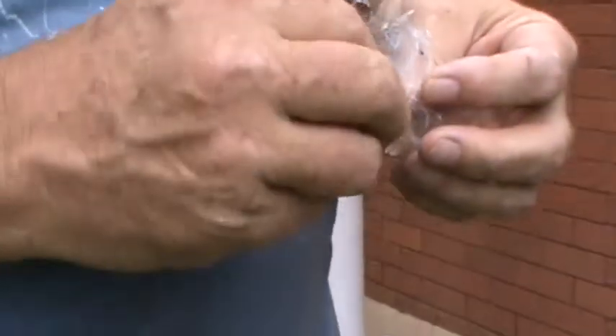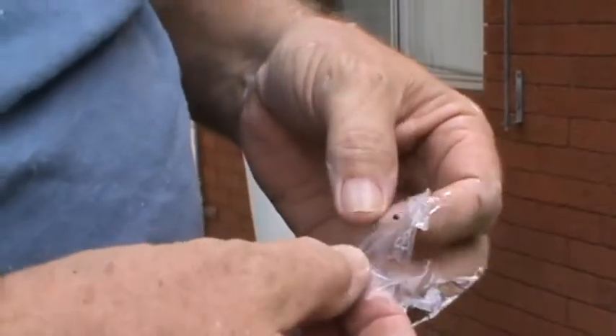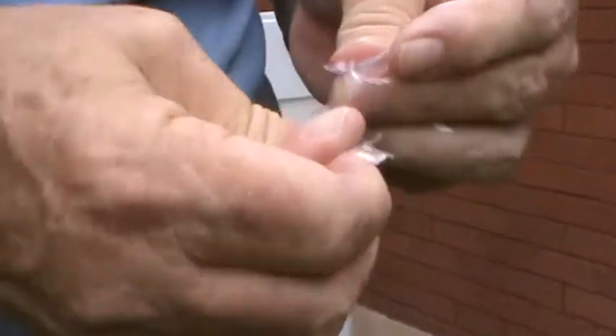After 24 hours this becomes very soft as a film — the waterproofing. But as you can see, we've left it 7 days now so it can cure before we put any paint on it, let alone any soil in there. It becomes a little bit more brittle but still very flexible — it's got plenty of good properties left in it as a membrane.